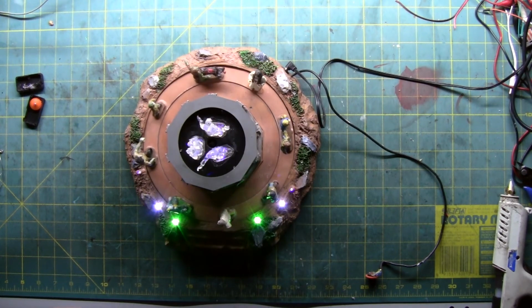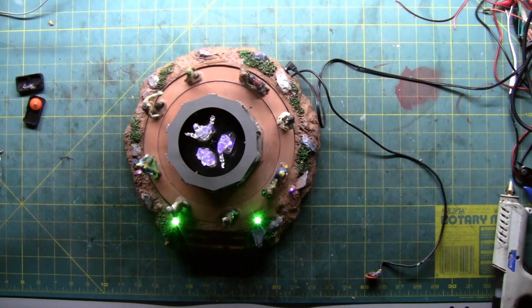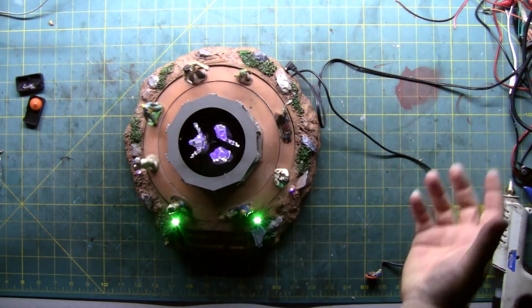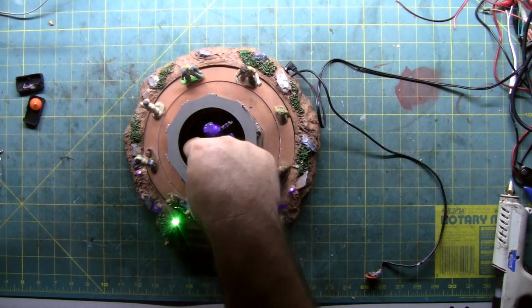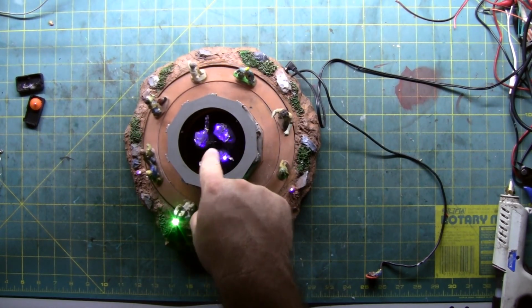I've never taken it apart before, but I can tell you what to do and not to do to make your life easier. To disassemble, remove the three screws that hold this hub. Pull the hub off. You can then unclip this guy. It has three clips. He only has one because they were broken off from the previous disassembly.